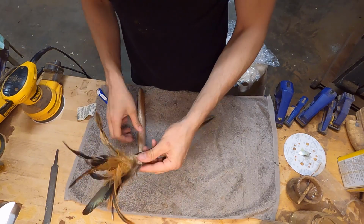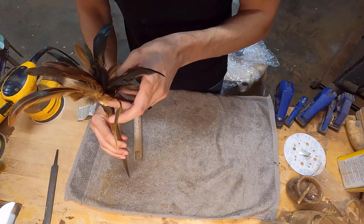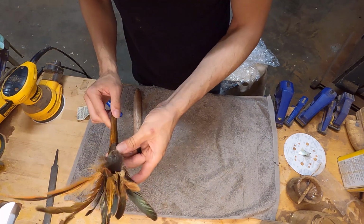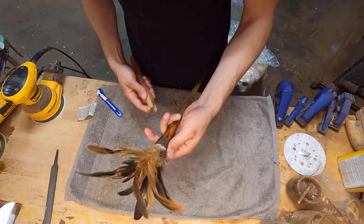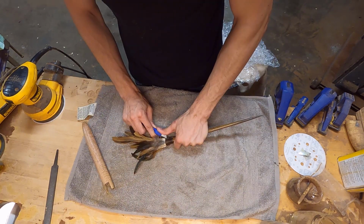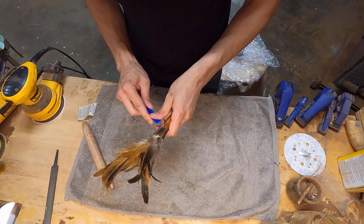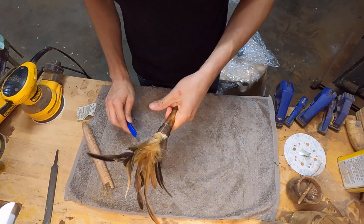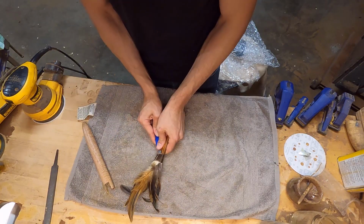I kind of thought that one of those legs on that tongue and groove joint had broken, but that wasn't the case. And so the only other option there would be that the tongue side, the marlin bill side, had possibly broken out. But I also noticed that my lashing was a little bit too far forward, and so it didn't actually wrap the joint. Which is part of the issue. The lashing should be right over top of that joint, so it adds additional stability. And I'd lashed it too far forward, so that was definitely an issue there.